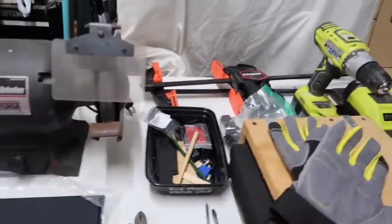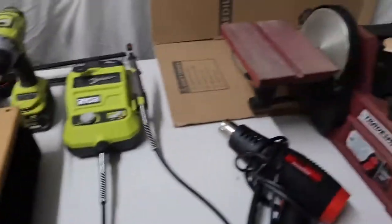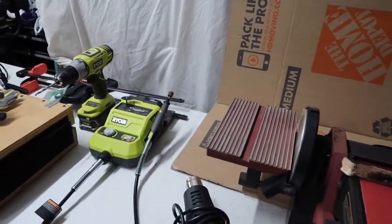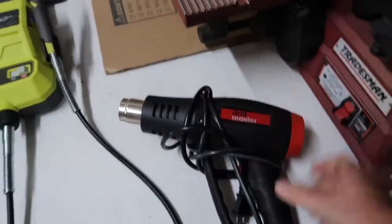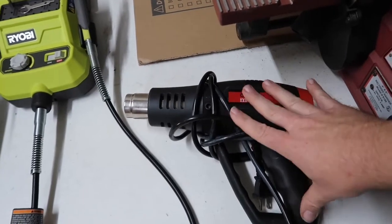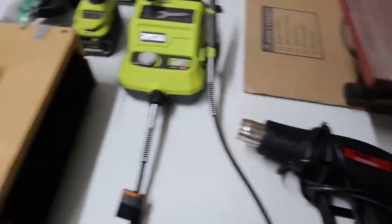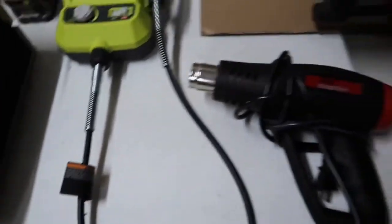Pretty much everything you see is what I use to make my holsters. If you have this stuff, your startup cost is going to be relatively low. If you already have a saw, you're good. If you can do the entire project with a Dremel, it's just going to take a lot longer. You definitely need the heat gun for heat relief — if you need a little more retention around the trigger guard after the press and trim, you can heat it up and press down. I also keep a little stack of rags handy so I can grab one and pinch the Kydex down without burning myself while it's cooling to its final hardness.